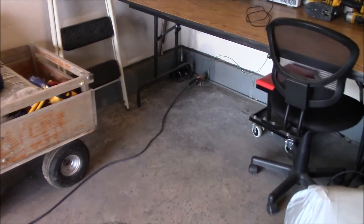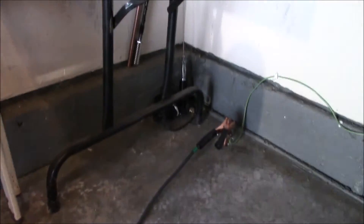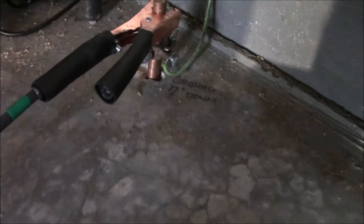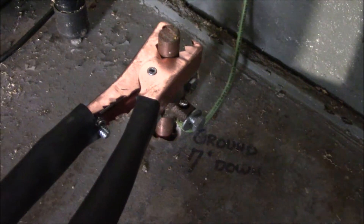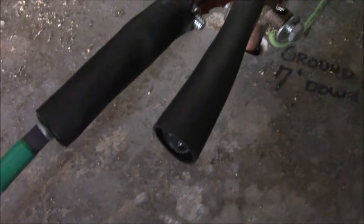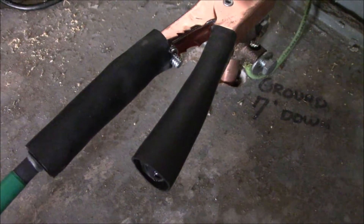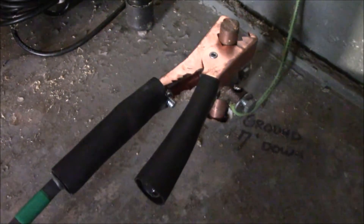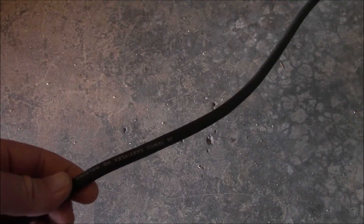Let's walk down to the grounding rod here in the garage. I sacrificed a jumper cable alligator clip here — this worked out really good. Got a bolt in there with a crimp on the cable itself, two layers of adhesive heat shrink, and some black tape, then put the original handle covers back on. This is really flexible stuff too — number four Temco welding cable.